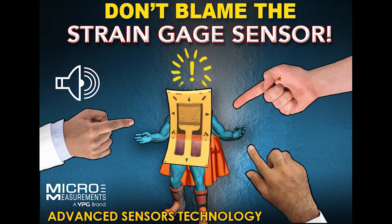Almost last but not least: applying strain gauges to bolted assemblies. Whenever you're dealing with high-precision transducers, assembly stresses from bolted connections can lead to things like non-zero return, and oftentimes the gauge gets the blame when really it's just the nature of how that part is behaving. When talking about transducers, we try to keep bolted connections some distance away from where you're actually measuring the strain. For a simple cantilever beam, for example, usually we try to stay two beam widths away from the clamped end, and that helps us get into a uniform strain field for good performance and good zero return.